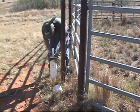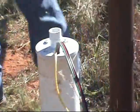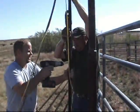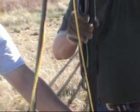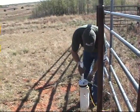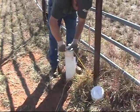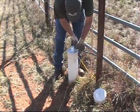Get everything aligned and slide the sanitary well seal in. It's imperative that if you'll be using these systems in freezing weather applications, you install a weep hole in the drop pipe approximately three to five feet below ground level, or below frost level for your location. Now we're going to tighten down the well seal since we've put our weep hole in, and we believe we're complete with our below-ground installation.